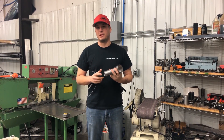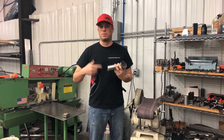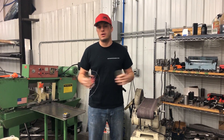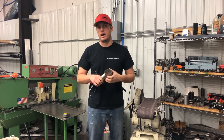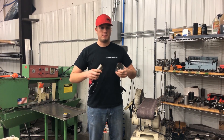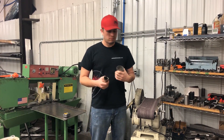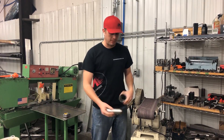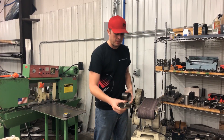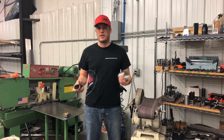That was something that took me a long time to learn. As my welding skills got better I'd do joints well, and then you'd come across a problem joint that just screws up the whole hot side or a whole down pipe — and that's disheartening. As I got these tools to help me make the joints better, it made all the difference in the world. The round mandrel is nice because you can actually cope a joint really easily — just take a straight pipe, mark the angle, eyeball it, run it in, and you'll eventually hit the joint.